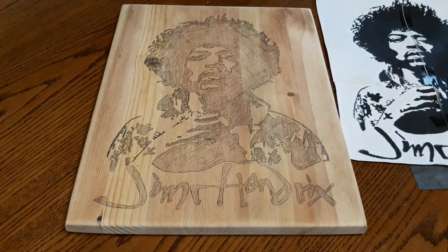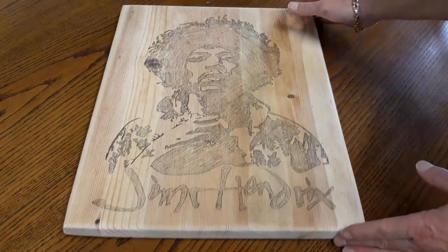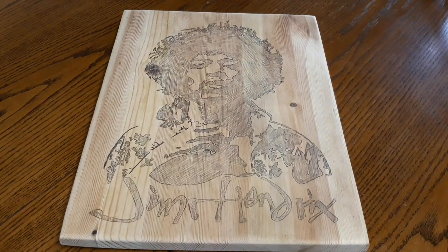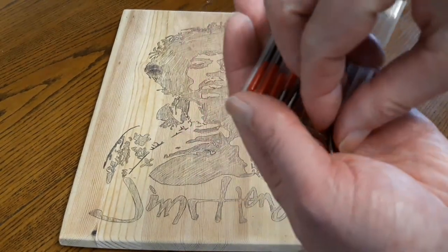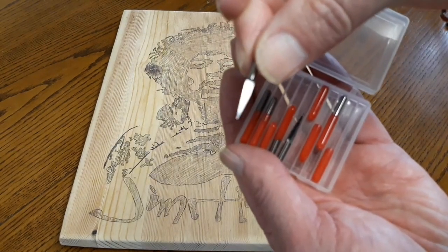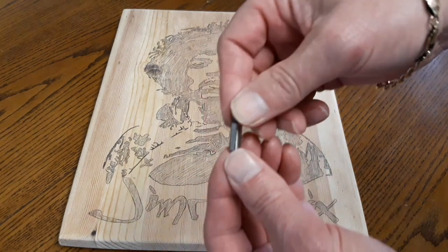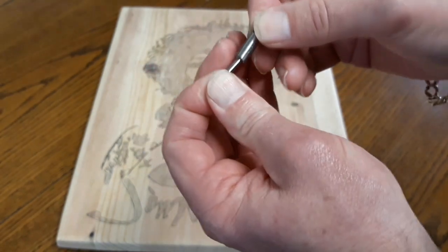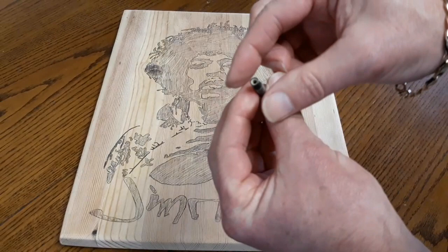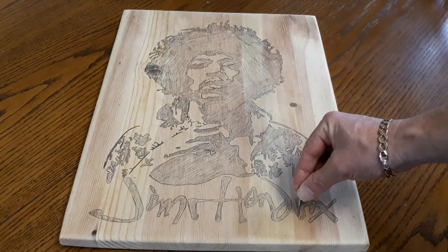That's our image we're going to route out today. The bits I'm going to use — my favorites — are these little CNC bits. You can get these off eBay or Amazon, they're really cheap but they do a fantastic job. Because they have a small shaft on them, you'll require a collet — basically that bit there. Your little CNC bit slots into the collet, and then that slots into your router because it now has a quarter-inch shaft on it. I'll use this one to draw around the outline of everything to the right depth.